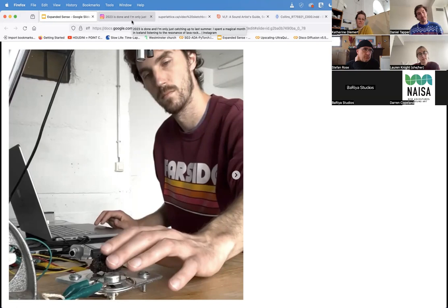I kind of went in without really a plan, and I just really wanted to do something really basic. So I brought just a bag of really small components, a couple of crocodile clips, and mainly a lot of little speaker cones like the ones you can see here. And kind of by accident, I found that by placing a speaker cone on the top and on the bottom and placing a lava rock on the resonating body of the transducer, I was able to create this really surprising feedback loop that was self-sustaining without playing anything through either of the speakers.